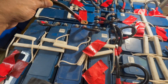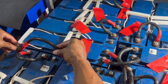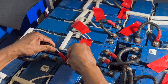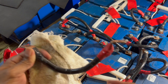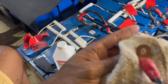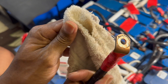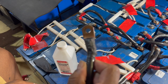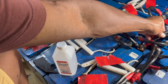Looks like it's going to work, so start screwing them down and keep jumping accordingly. Also, while putting these on, take some alcohol and a wire brush and wipe the acid residue off of both sides of the terminal, as you can see, so you can make a good connection on the battery terminal. Just like that — then you'll have a good connection while connecting them.